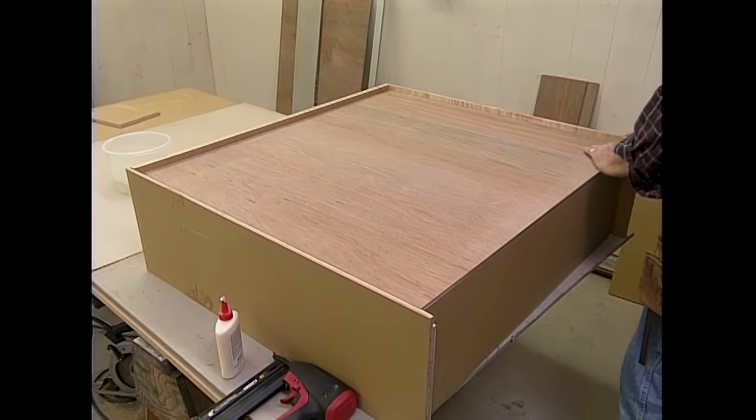The next thing I want to do is build another base cabinet. It will line up with the upper cabinets — it will be open storage, no drawers. But the front will flip up and be supported by some fold-out legs as an additional work surface. I'm also going to take advantage of that and mount a router in the top later. I've pre-cut my side pieces. I've set up the stacked dado head cutter and I'm going to make a groove for the bottom shelf. Here I've raised the dado to 3/8 of an inch and installed this sacrificial strip to make a rabbet for the back cleats. Here I've pre-drilled some holes for screws to attach a cleat which is going to tie the front of the cabinet together.